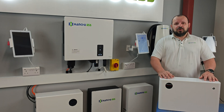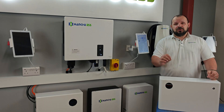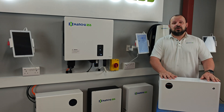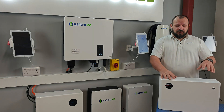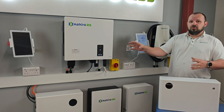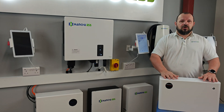How we're going to do this — we need to make sure that the new battery you're getting matches your existing system. The figures you'd be working with would be around 55-60% state of charge, and the voltage would be around 52.5-53 volts in the battery when you take readings. We need to make sure that your existing battery matches this current battery.